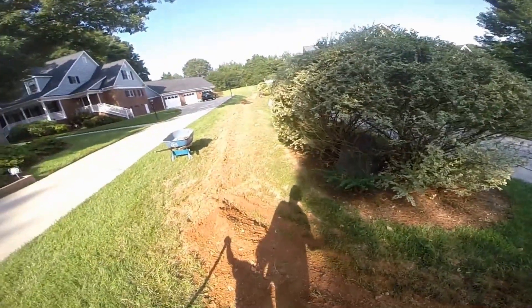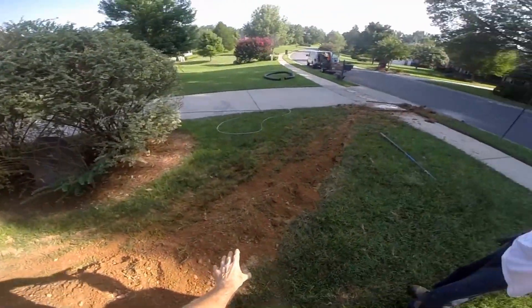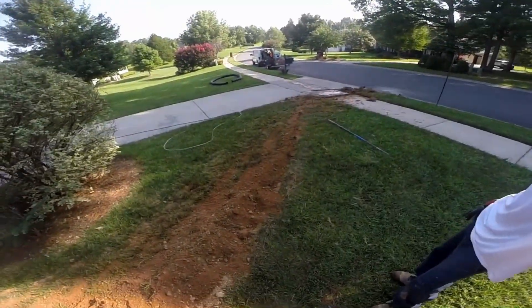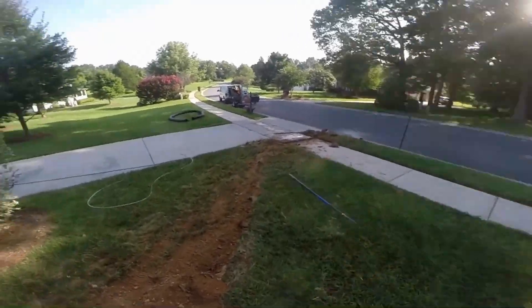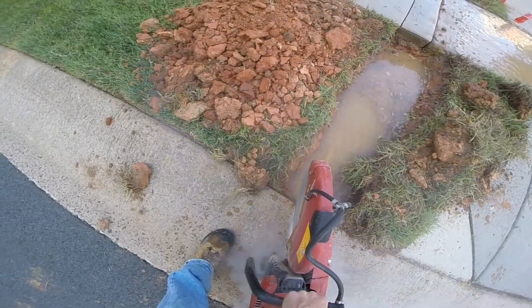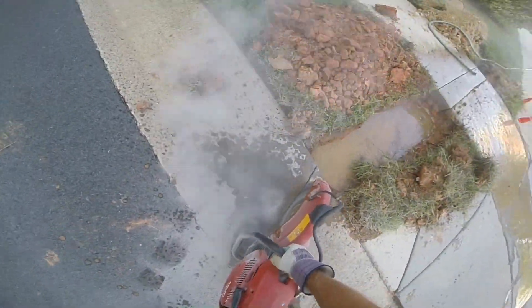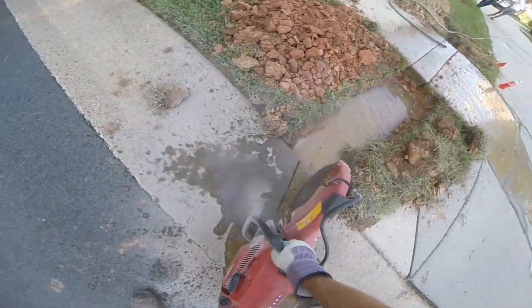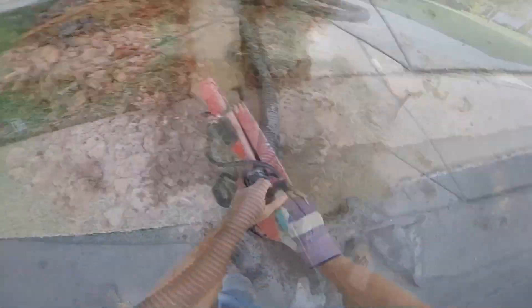You can see our line goes all the way out and through the sidewalk — something homeowners could easily do themselves, but I would suggest you rent a machine, whether it be an excavator or a trencher. The trencher does a great job and knocks this out in just a few hours. Next we're going to cut the curb — I already cut the walk and now I'm cutting a V into the curb. This is a half-round curb, and I've sped the video up here. For half-round curbs I usually make a V cut, and that allows the water to come out really nice to the street.